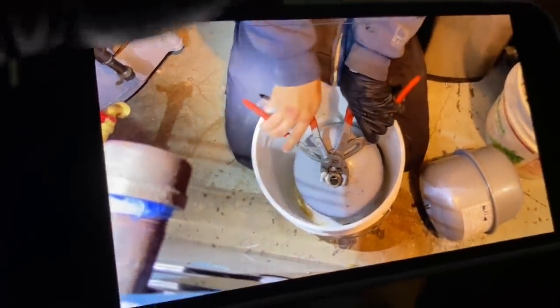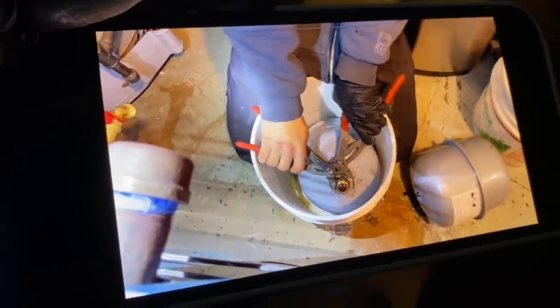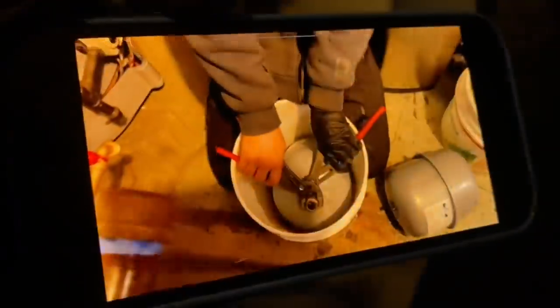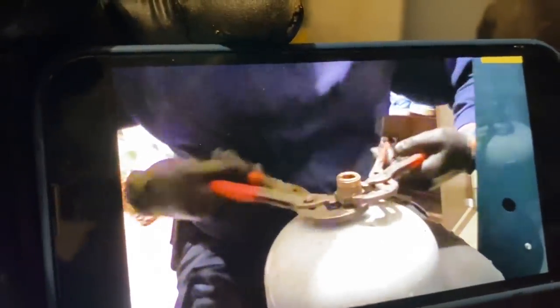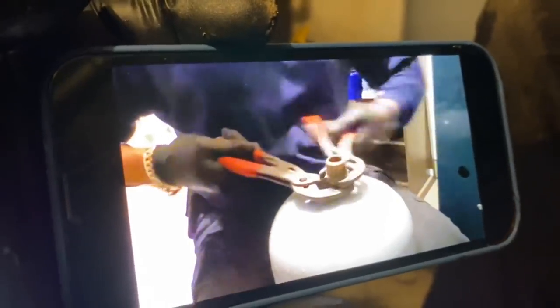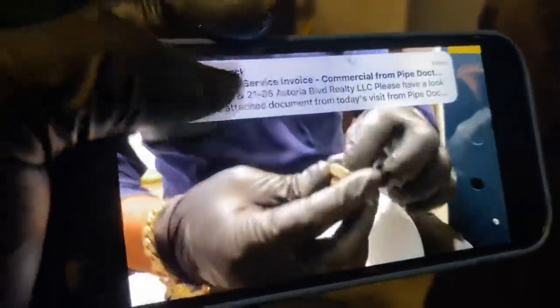And what I did was, right? You're trying to pull them apart, right? Is that a given? Yeah. Okay. Now, let's look at what I did. Now remember, you were trying to push the two levers of each wrench further apart. I'm going closer to one another, right? And that's the difference. It's all about the leverage. You have more leverage by trying to push them together than to push them apart. Okay? There you go.